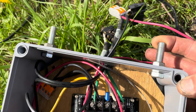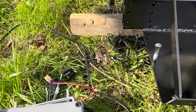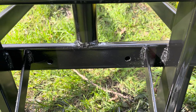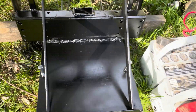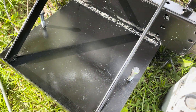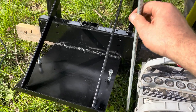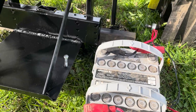I drilled through a pair of bolts so that this box is going to mount above the batteries right in the middle. You can see those two bolt holes - the box is kind of protected by these supports here, and our two batteries are going to go right down here. I've actually welded a nut on the bottom, and this is going to be for a threaded rod which will go through there with a crossbar as my battery hold-down.